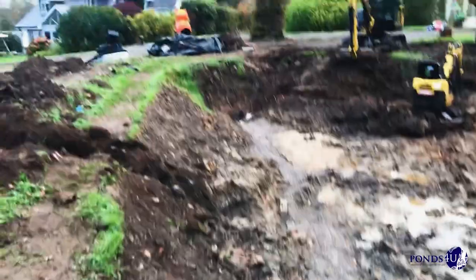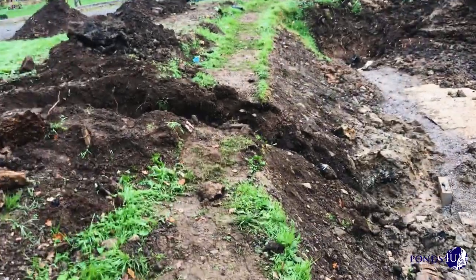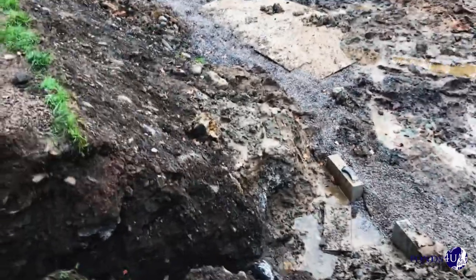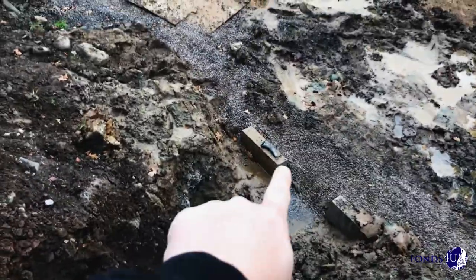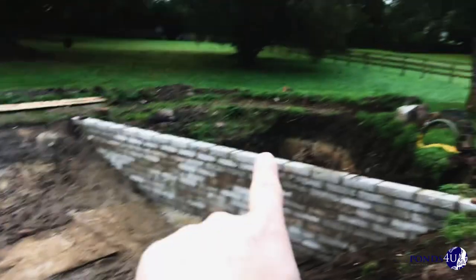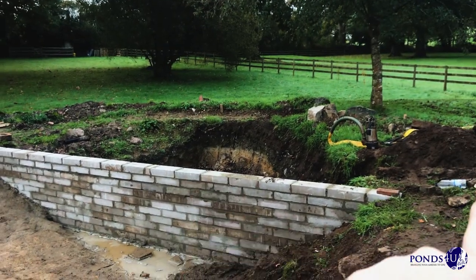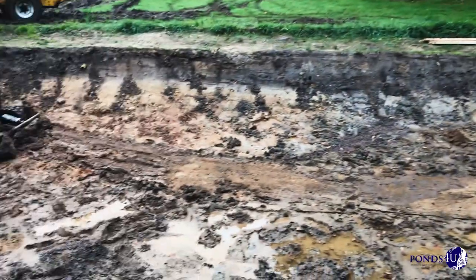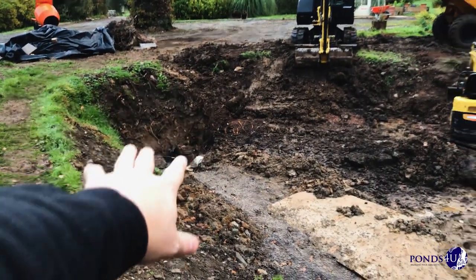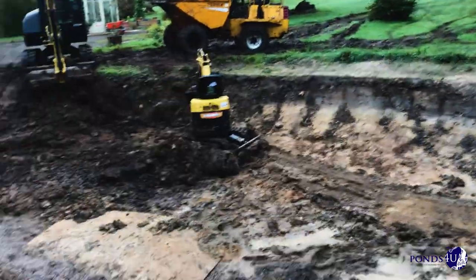Hopefully now guys this is going to start looking a bit prettier. We've got 10 ton of gravel coming today to finish the land drains. So we'll run pipework now — cut this, clear the gravel, connect the pipework down there. Same on that side, connect the pipework, bring it in, gravel it all out. Fill that one in, connect that one up as well. And then we can start clearing this, backfill and make it all look nice.